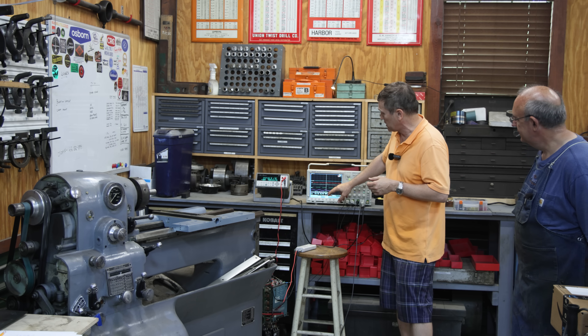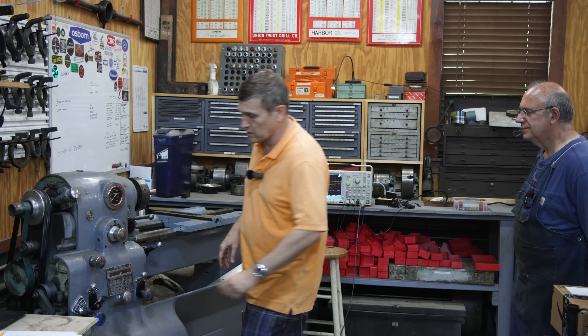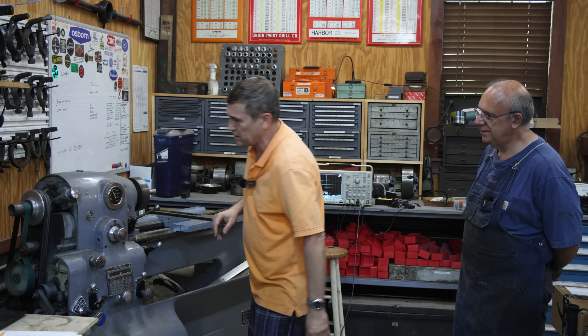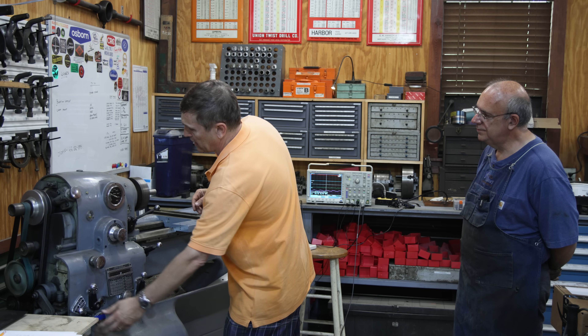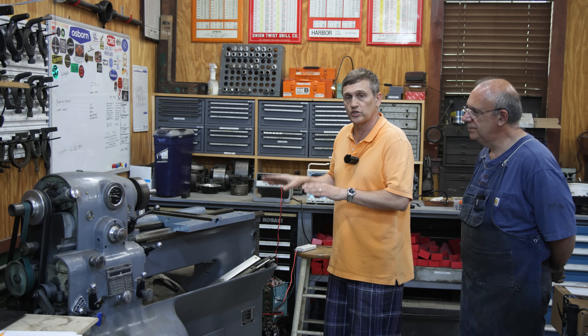We can demonstrate now. The oscilloscope is showing armature current in green, field current in blue, and field voltage in red. We can start it up at any speed. Here we are at maximum speed, 3000 RPM, and the main thing is it's running very smooth — it's not hunting at all. We can dial in a lower speed. All of this speed control above 1000 RPM is happening with field weakening. We went from a field current of about 0.97 amps, which is the maximum at below 1000 RPM, down to something like 150 milliamps at high speed. With the digital speedo showing about 1400 RPM, it runs very nice and smooth.